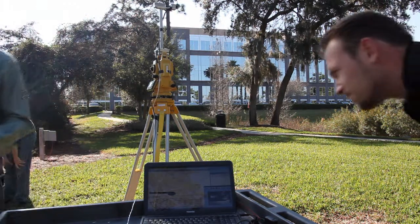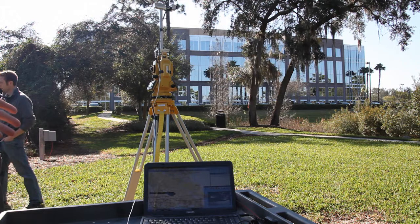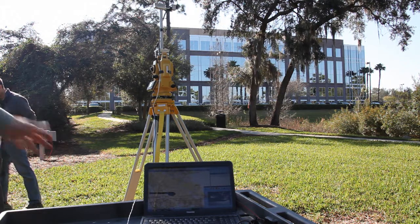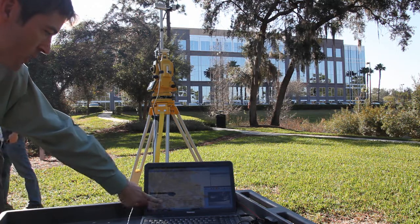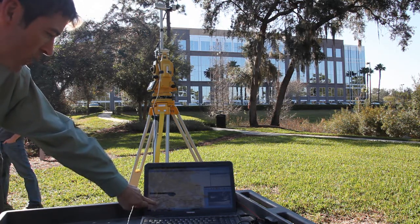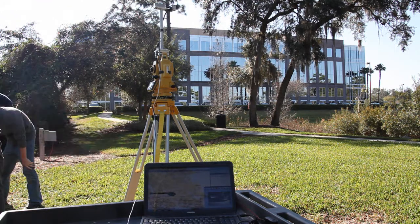So on the theodolite, I've now moved exactly 5 degrees. You can see on the screen it does show that the WOM has actually changed. Right now the OptoWOM is reading 235.1 degrees. The WOM by itself is 234.8. Both are good, within plus minus 0.2 degrees. Now we'll do a firing event.